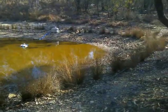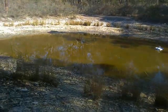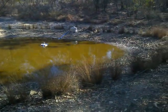Have to do it in still air at the center, midday and all the rest of it. Haven't really got the water to nail it down any closer than that. I'm going to go with 1,100 square meters, upon which I can make it rain dam water. And with this setup, probably for about 4 hours, as long as I refuel the pump at the halfway mark. After which time the fire front will probably have passed and I can switch the pumps off. At least that's the grand plan.